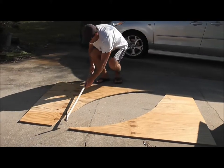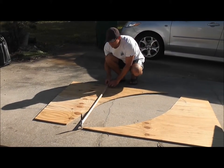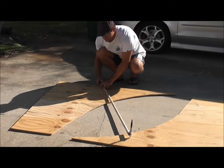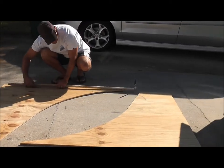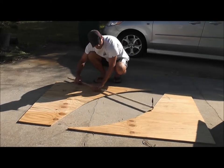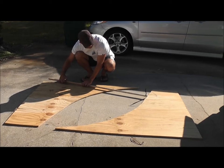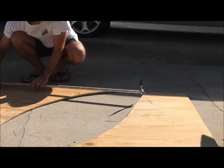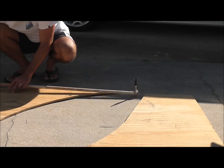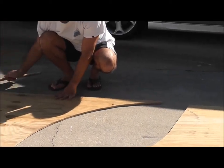At the top of the board, nail it and just allow that to swing along on that nail to draw the design. When I got to this point, I just put a straight line out from where the curvature ended to eliminate the vert, because I didn't want to have any vert. So that's how you make it.